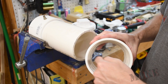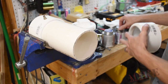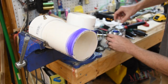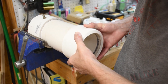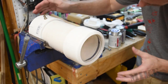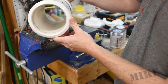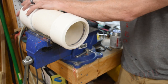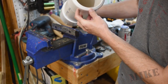I don't want to get purple primer on my acrylic window, so I'm going to be extra careful. I'll prime this first, then this, so I can do it all in one shot — a bunch of purple primer on both and some blue glue, shove it on here, give it a little rotation to spread the glue around. That's not moving — this blue stuff sets up pretty quick. I'll probably have to Teflon-tape these threads for sure. There we go, not half bad.